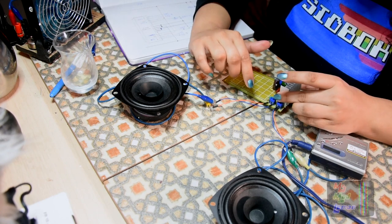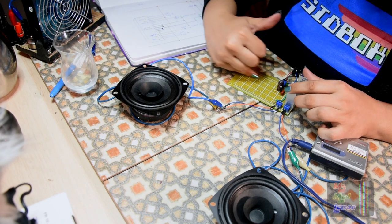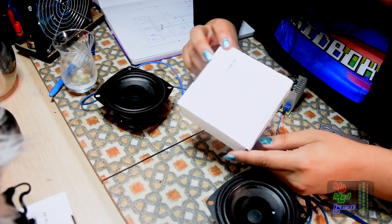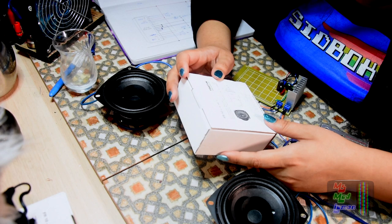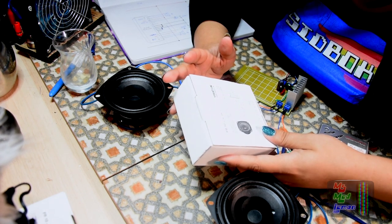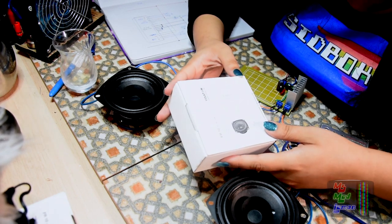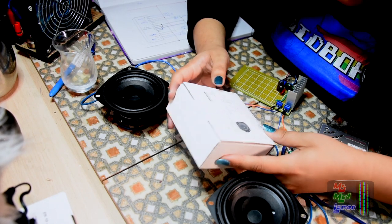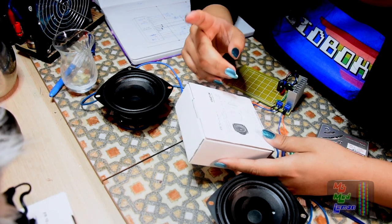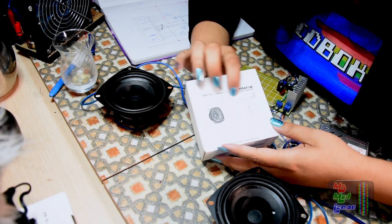The power amp is done for the speakers — fantastic! Now I can start doing the headphone amp on this very same board. The rated power on these speakers is 30 watts, but the maximum says 50 watts — I don't even take note of that. That's PMPO, it's a peak figure. It's like saying the fastest speed of a shopping trolley if you roll it off a cliff — technically true, but that's not what they tell you. Anything could be fast if you do that to it. 30 watts is the rated power on these.